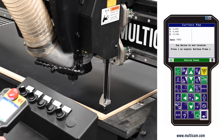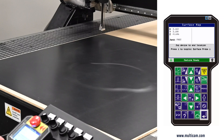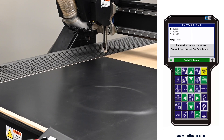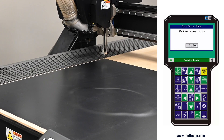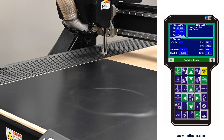I can move down to an area where I can physically see where I want to get started and press enter. Then I can move over to the back or end location — we can only do rectangular shape areas — and press enter. It will ask for a step size. If you're truly doing the full table, I'd suggest 2 or 3 inches, or 50 to 75 millimeters, since we're going to spline all the Z-axis points. For this small area, I'm going to do one inch or 25 millimeters.